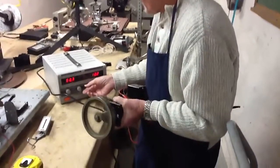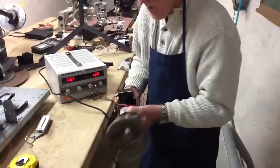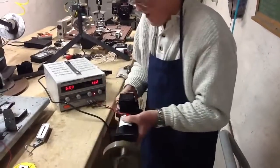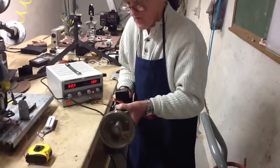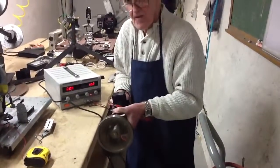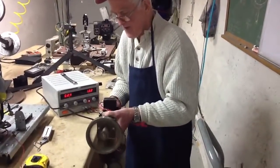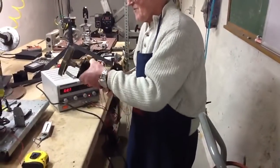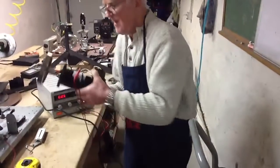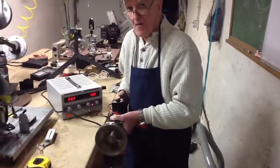The thing to note is the amp meter doesn't change no matter what kind of load we put on it. Here's the natural load; here's the power load. I am feeling that torque — it is putting out torque. It's hard to measure, but it's putting out that 31 and a half inch pounds of torque that it takes to hold this thing up. If we had it on a pivot, it would actually precess and then we could force the precession and it takes itself up. But the important thing is we had no change of power when we loaded it as a gyro.